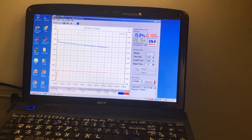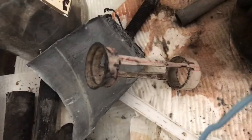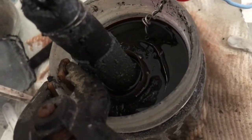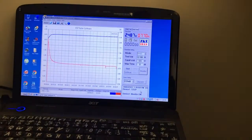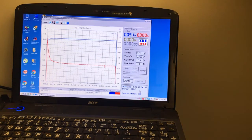Yeah, I'll get back. Okay, cell's been on charge for 2 hours and 30 minutes. Trying a separator instead of the PVC frame thing. That's our zinc build up. I think it was getting, well, this will prove it maybe, dendrites at the bottom, so hopefully that piece of separator will stop them from touching the carbon. So I'll just disconnect the charge. We'll be able to tell probably.